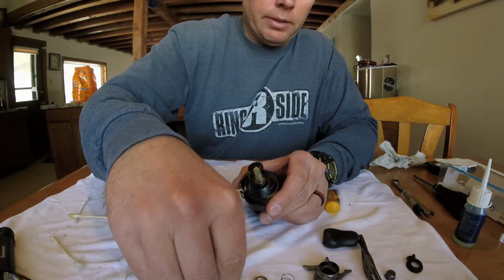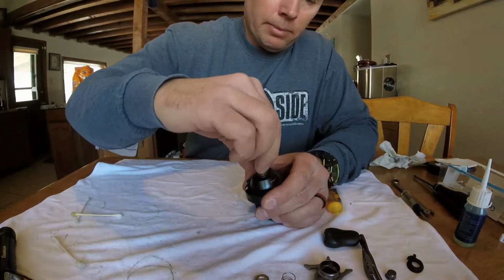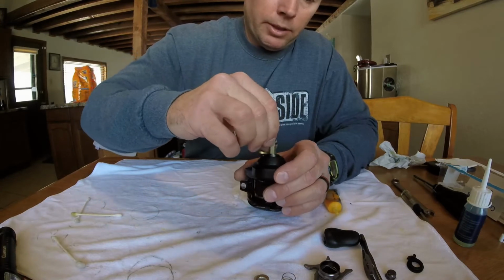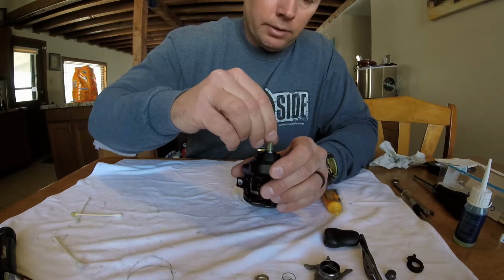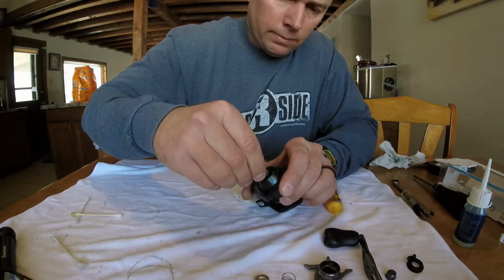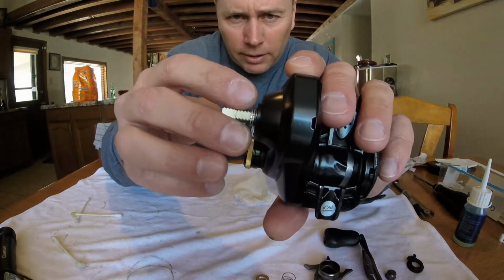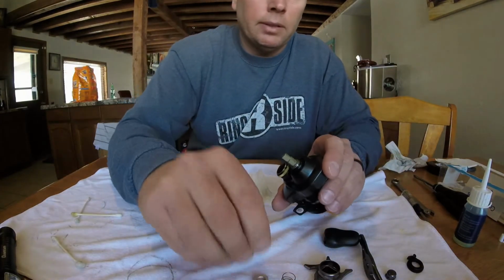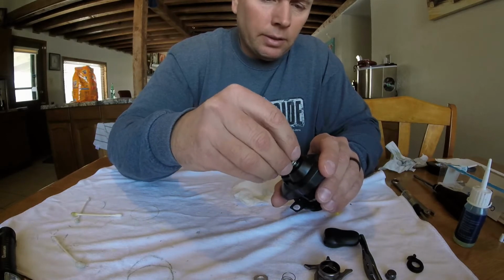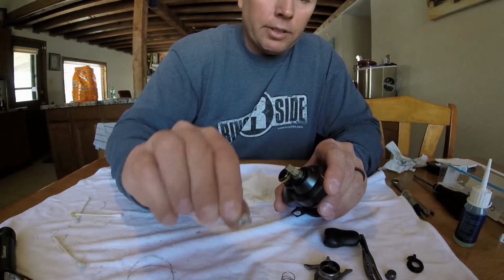I put these two here together, the concave C washers, and I will slide them on. They should match up with the shape of the shaft here. Okay, so when they're on, they look like that. They don't sit flat against each other. Then we have this copper washer that goes on next, and then our aluminum washer here that's square.